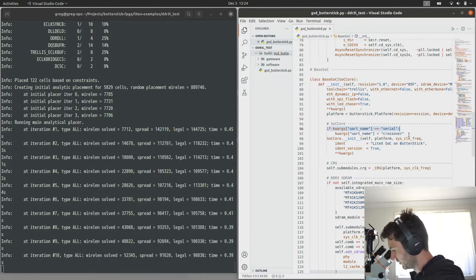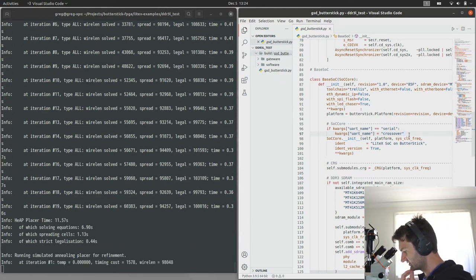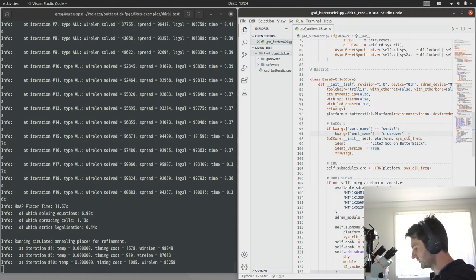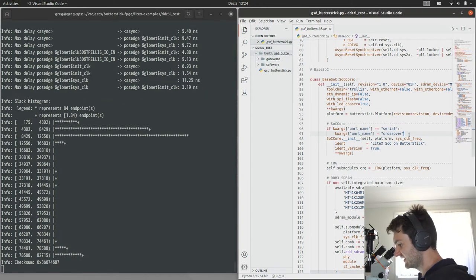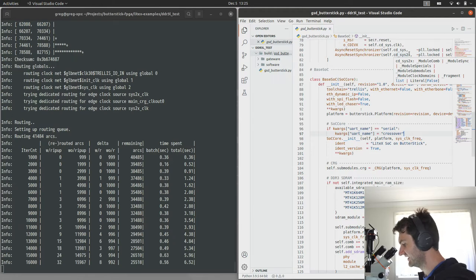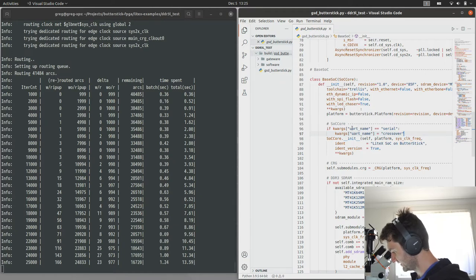And as I mentioned here, if serial is mentioned as a UART name, it will enable crossover mode, which I don't think we want. That would let it run the serial terminal through the Ethernet instead of through the UART, through what Litex calls Etherbone, which is more or less an Ethernet to Wishbone adapter that could let code on your computer talk to a Wishbone bus in the SoC via Ethernet. But we don't want to do that here. We just want plain old serial.